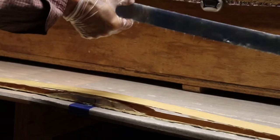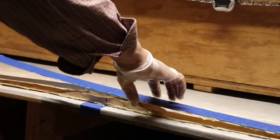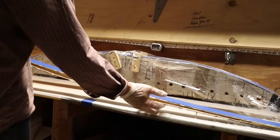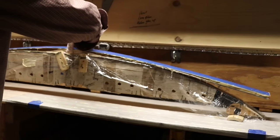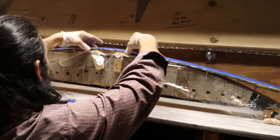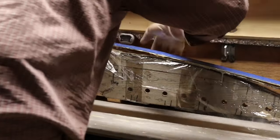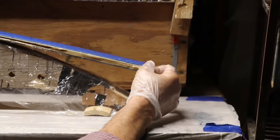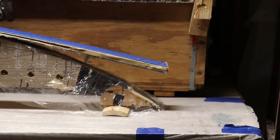Place the last lamination onto the sandwich, making sure your center lines all line up on the riser. Then just pick up the sandwich and put it up onto your form. The form has to have cling wrap — plastic wrap — covering it; otherwise you're going to glue your bow to your form. So put cling wrap over the form, place your bow sandwich in the form, then cling wrap over top of that. Check the ends to make sure the wedges didn't slide out and that everything's lining up with the very end of all the laminations.